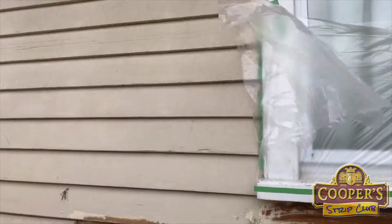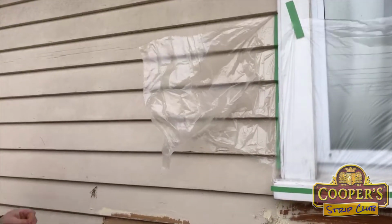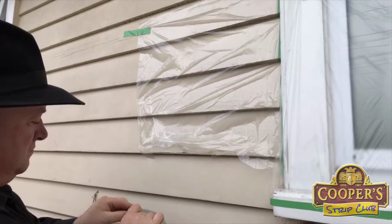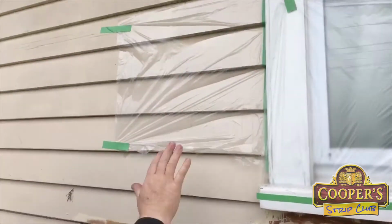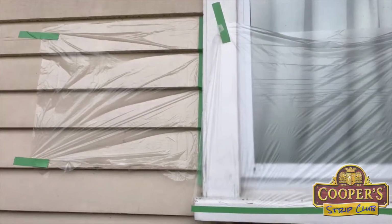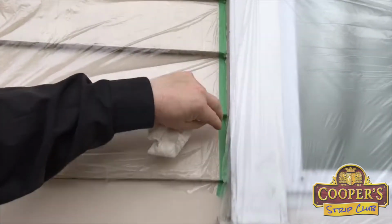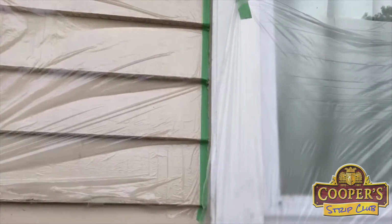Let's get myself a bit of tape. So you've now got a stripping surface where, if I was stripping the window, I can strip without wrecking my weatherboards. You've always got to be wiping bits of surplus off. The risk area is the stripper getting underneath the tape, so you sometimes get a few little bits of bleeding underneath, but if you've rubbed that down really firmly, and as you spray, wipe off as you go, that gives you a pretty good result.